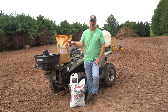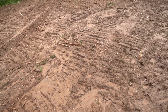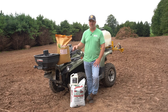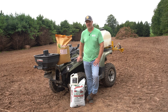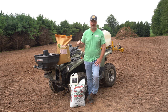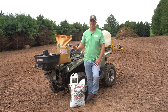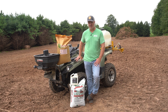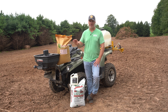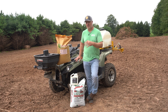The other thing I want to point out is that, as you look at the dirt behind me, this is actually pretty decent dirt. We didn't want to go pushing a lot of this topsoil off into piles and losing that fertility off the dozer blades. When you get done with a dozer project like this, if it's been done well, you're going to have a lot of the topsoil left, but also a fair amount of debris in the food plot for a couple of years — some root matter and sticks, all to be expected, that will go away over time. It's necessary so that we don't scrape all the topsoil off. We've actually run the disc through this one time already and I think the seedbed is going to be great.